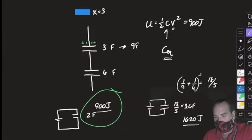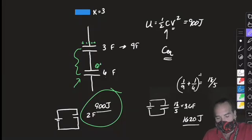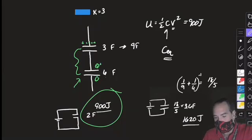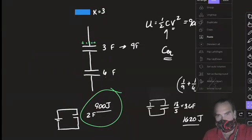And even though there's this part here in the middle, and we can say this capacitor, it's not changing. So could it accept more charges, or could I pull more charges from it? You can't. Because whatever amount of charge is on this plate that's positive has to have an equal amount of charge on this plate that's negative. That can't change. So in this example, we are going to be manipulating the voltage because we're changing the electric field, but not changing the charges.